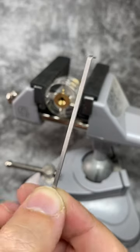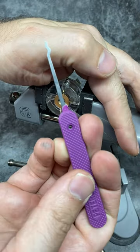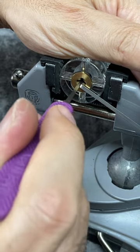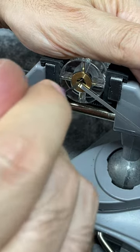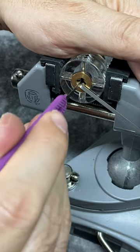How can you go about picking one of these? Well, just like a normal lock, apart from you have to pick four different sides. You first tension it, then you get your favourite lock pick. Here I'm using a rake, and then you keep going around each of the four axes of pins in turn, trying to pick them. You can single pin pick them, or you can do what I'm doing here, which is to use a rake to scrub those pins in turn each side.